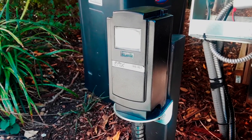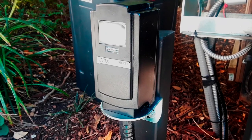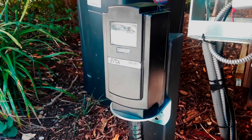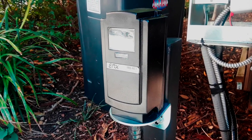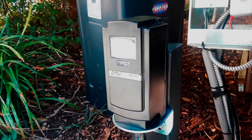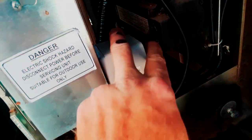I think it's an IRB monitor 4 XT or something like that, and replaced it with this IRB RET — this is kind of the standard photo eye I'm going with. Over 20 feet in length, it is a UL325 photo eye. It's nice that it's not a double-head; if you don't need the range you can just run a wire down one side.